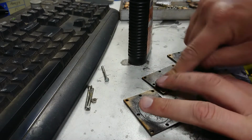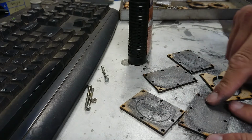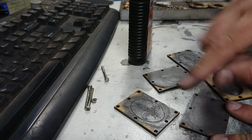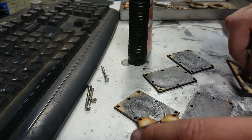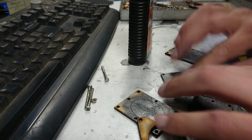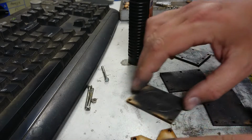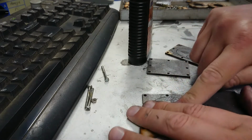I found graphite was the difference between my molds gassing off and making bubbles in everything, and actually getting a nice smooth finish. It did seem to provide a bit of thermal protection as well. I don't know how well that's going to work this time, but I'm pretty well going into this expecting to fail, but I don't know for sure till I confirm that. So sort of a bit of a pessimist, scientific approach here.